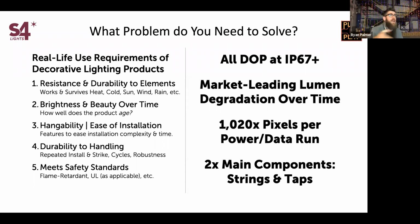Absolutely. So IP rating, ingress protection rating. For those of you that aren't familiar, the two different numbers are associated with what size particle we are dealing with, and does it keep out particles as big as your hand, or does it keep out sandblasted particles as they're coming at you or forced from a water jet? So when you're looking at IP rating, it's really talking about the protection that it has against the elements. Now, a lot of people associate this strictly with water when we're talking about the installation of decorative light strings, but it's really beyond that. It's ingress protection in general. So that in Texas and Arizona and Southern California, we might want to talk about ingress protection against dust, you know, sand particles and things of that nature.